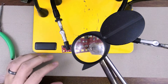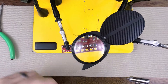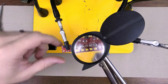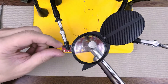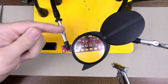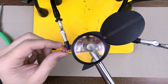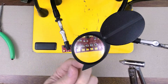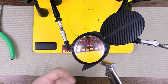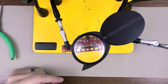And this helps you eliminate that problem of it sticking to the side. What I do with this is I apply the desoldering iron, suck up the solder by pushing the pin forward, then do it again pulling it back. This way, it's able to pull the solder from the front side when I'm pushing it forward, and then when I pull it back, it pulls the solder from the back side. So then I get solder from both sides of the pin, leaving us with a nice clean through-hole.